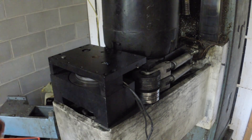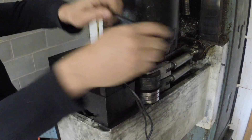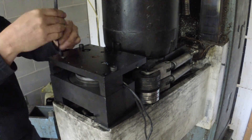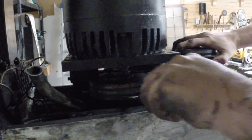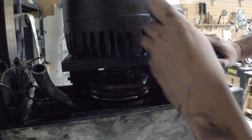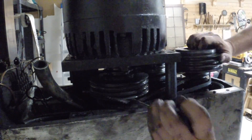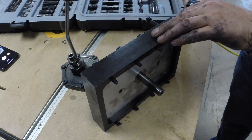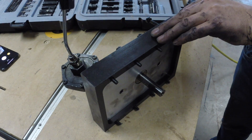Now I'm taking away all these bits — these are about the tool changer that pushes on the drawbar. Here I'm removing the straps using a screwdriver. This mechanism is what pushes on the drawbar to release the tools.